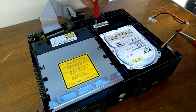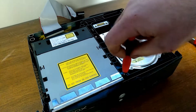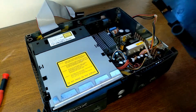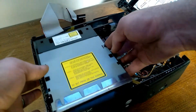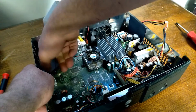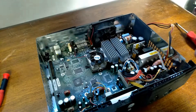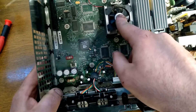There's three of them. Remove the hard drive and set it aside. Remove the optical drive. Finish unplugging the power connector — which is not computer-like — remove the IDE cable carefully, and the power cable. And here's the inside of the machine. We have the CPU here, and the GPU with its little cooling fan.